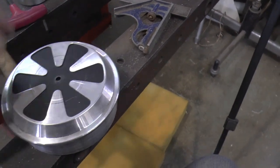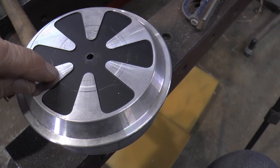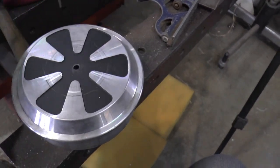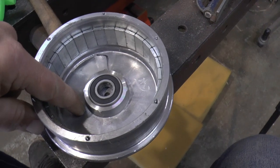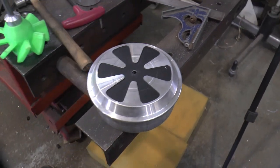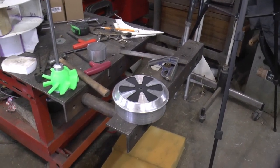On each one of these high spots — I don't know if you can see it — this is where the outside of the aluminum is, and this is where I'm going to put my screws, in each one of these. There'll be a hole, and then a corresponding hole here, and tap. The screws will be countersunk on the inside, and there's just enough room around this bearing pocket for the screws. So that's where I'm at — I think probably this will be my next move, and then figure this shaft and stuff out.